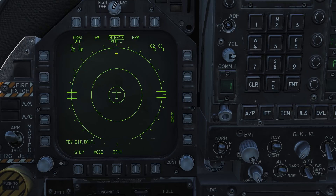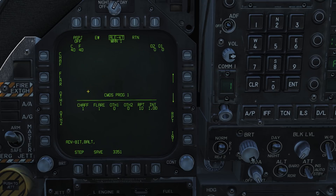Cycling back to MANUAL mode, we will now review how to configure our manual programs. You can do so by pressing the ARM push button. It will display the currently selected program. You can see here we have CMDS PROG1. PROG1 will dispense one chaff, one flare, and will do that program ten times with an interval of one second each. We can configure these options by pressing the buttons on the side: chaff, flare, our GenX expendable bays, the number of repetitions, and the interval in between them.